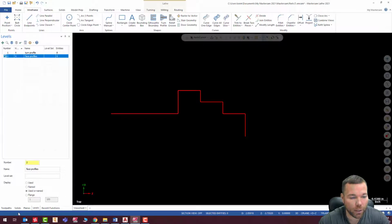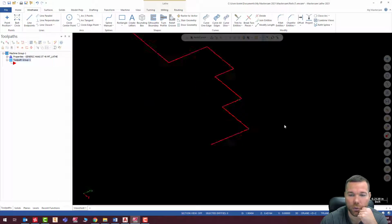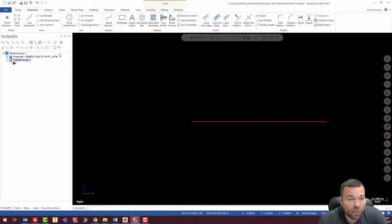So we're going to work on this plane now, and the plane's okay. All I'm going to do is hit right and go to the right side, and we're going to start out with this hex. Oh, and by the way, it shows you a different UCS down here. We are technically still going to enter things the way we would if we were in the DZ plane. So we're still going to enter them X, Y, Z. Okay? So just keep that in mind when we enter our coordinates, I mean.